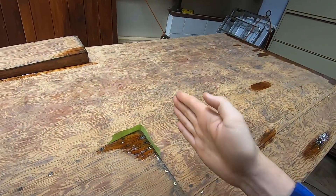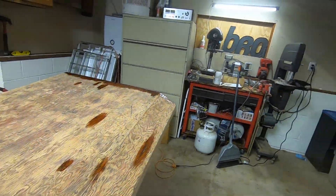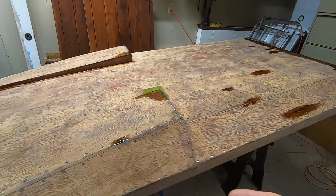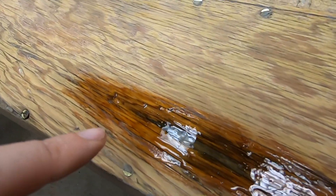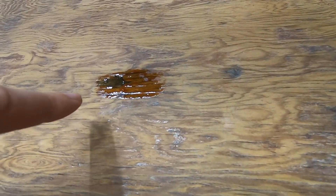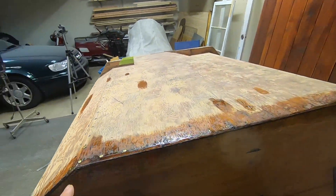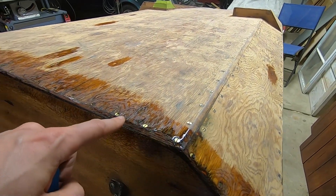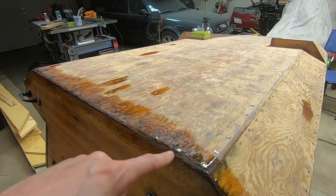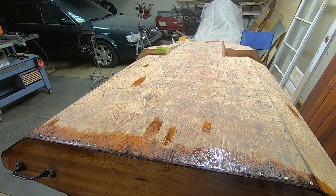The repair patches of epoxy are on. One thing I tried here was adding some tape to rebuild this corner and then putting a big dollop of epoxy right there. I tried the microspheres or filler to make a thickened epoxy but I didn't really like the way it was turning out. Once I sand this, it's going to be pretty flat. I also put a coat on this back edge because I want to start building it up — I'd like to have a pretty sharp corner there and it's beveled. We're going to wait for this to cure, sand it, and then it's time for more coats.